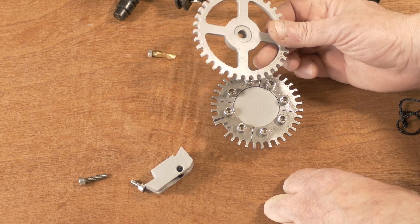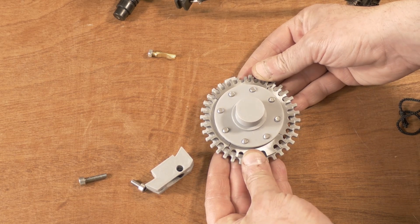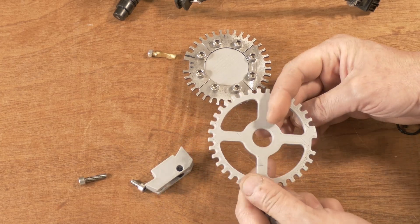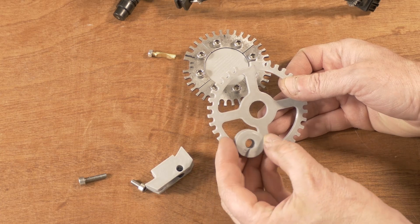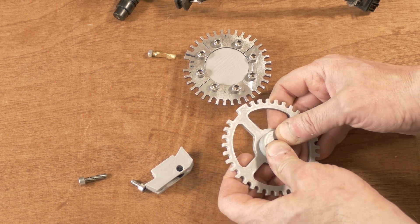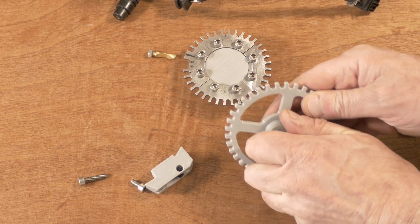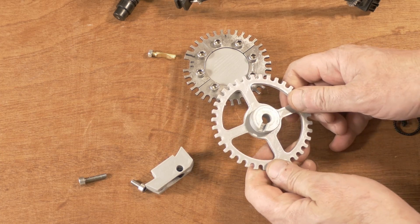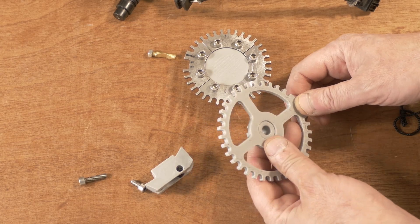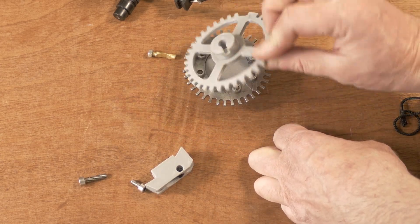I also wanted to see if it was possible to fit something just a little bit bigger in the allotted space, so I went with this option in the end. This is obviously a 3D printed mock-up and it is a little bit bigger than the original design. If this is machined from steel in two pieces - the rotor and then the hub with its keyway to connect to the crankshaft - and I leave these separate and just bolt straight through, then I've got the option of adjusting the position of the rotor to get the timing right, and then I'll drill a hole and put a pin through to lock it in place.